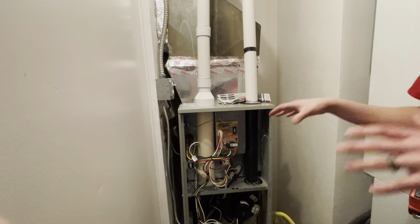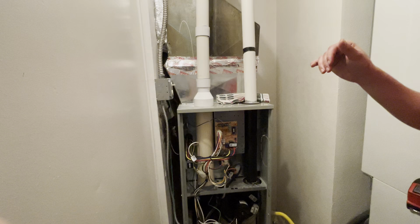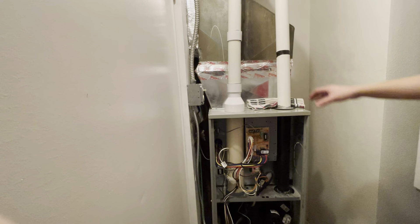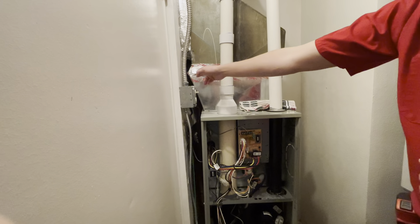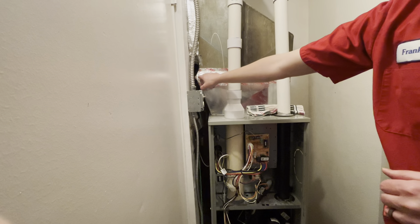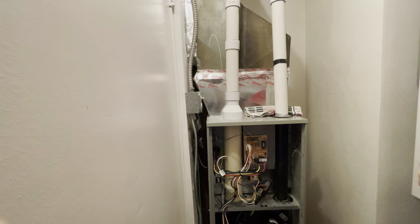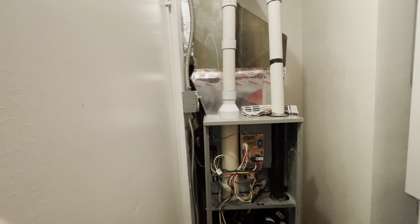It's got a couple of different speeds that will kick down to it and make it quieter for you. And I want to address this right here — they kind of squished this together and made it work, which I'm not too big of a fan of. It looks like they tried to do a high efficiency takeoff to transition this and they just kind of plopped it together and taped it all together. If we can correct that and make sure we're in line where we need to be, to make sure we don't have any excess random air coming in through this, that'd be ideal.